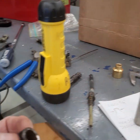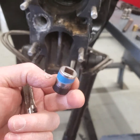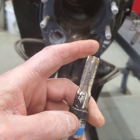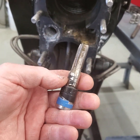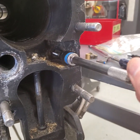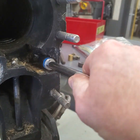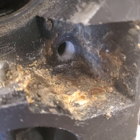What I do is take a standard 12-point old half-inch socket from my toolbox. That fits right in a 12-point, just like it was made for, and then just electric tape it together — it's a shortcut. You've got it in your arsenal ready to go next time. I've got that pipe tap started in there and I'm going to run it in by hand just to clean those threads up. A little corroded, but the threads are in good shape.